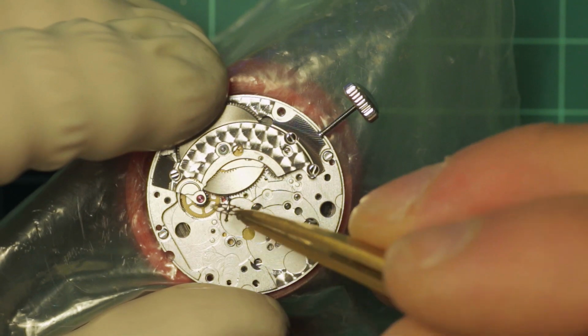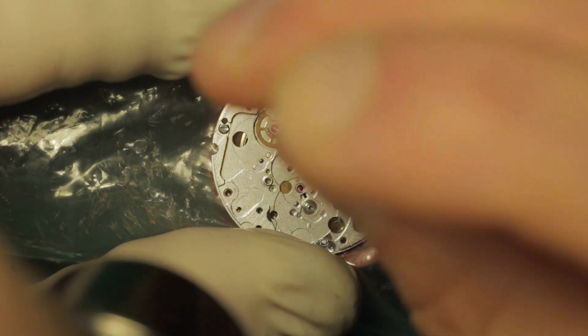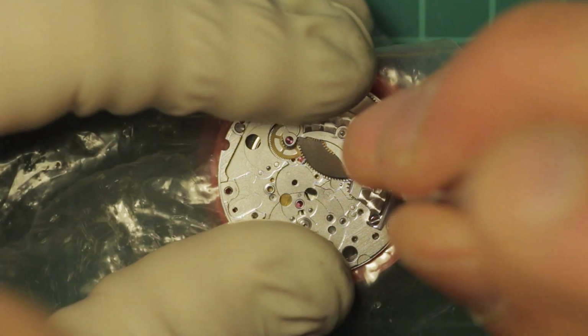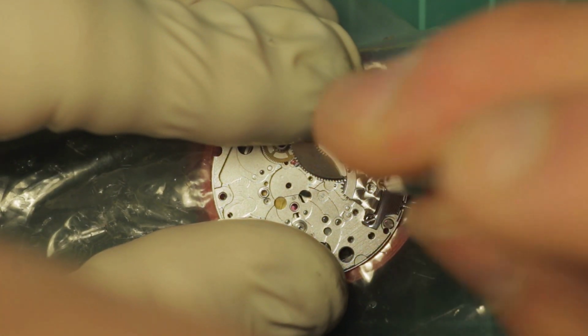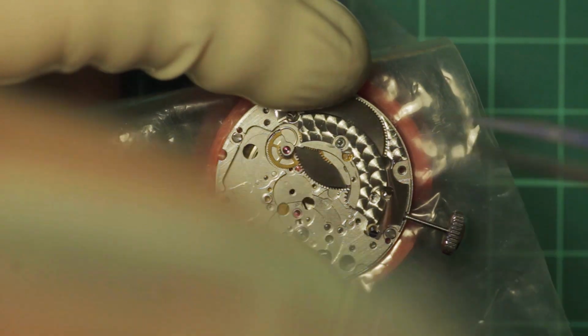And there you saw the escape wheel. The escape wheel is actually quite an unusual one on this watch. It's double-ended. It has gears at both sides, one of which is driven by the 4th wheel to turn the escape wheel, and then the gear on the other side, which passes through to the dial side, drives the gears that turn the small seconds at the 6 o'clock sub-dial, but you'll see those shortly when we get onto the stripping of the dial side.